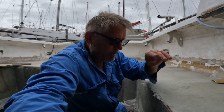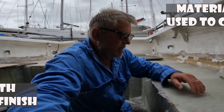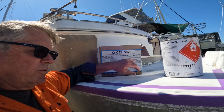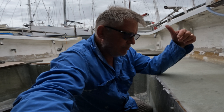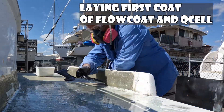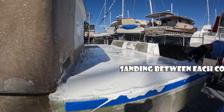There's a few different ways we can do that. One way is we don't remove it at all — we just put a speckle paint over the top and that draws your eye away from it. Or we can do fairing. There's also a third way: using a veil or tissue paper — a very thin, light fiberglass material — lay it up over the top and it flattens it all out and removes the print-through. After that we add a fairing material — a mixture of flow coat and q-cell microspheres — which provides a very easily sandable surface so we can get it very smooth and looking really good.